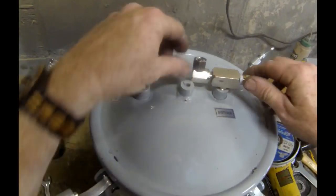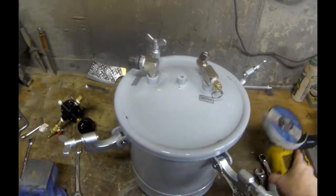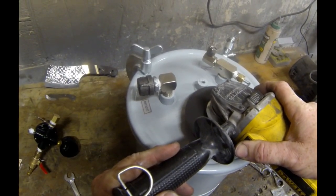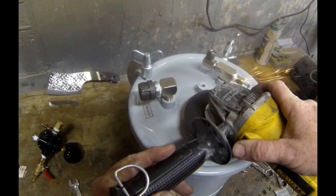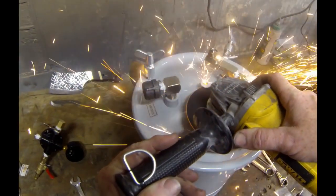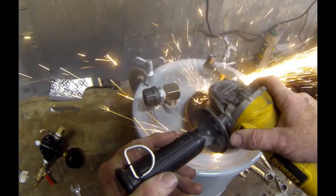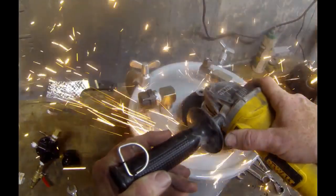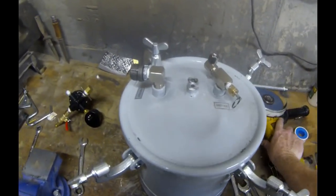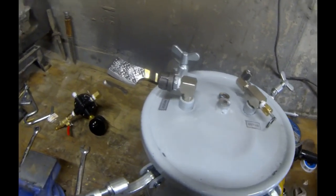The problem is I can't unscrew that fitting because of a welded flange on the lid with tapped holes for the handle. So I'm going to use a disc grinder to reduce the height of that — not cut it off all the way, just take off about a quarter of an inch. That should give me the clearance so that the fitting can completely turn, allowing me to loosen it and take it off to see what the issue is.